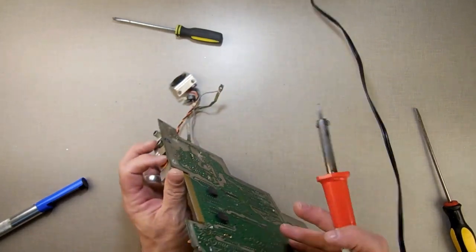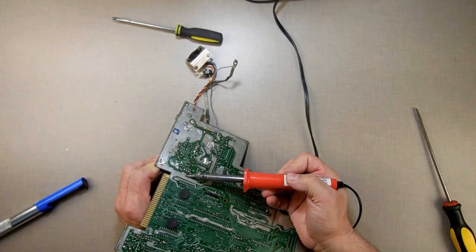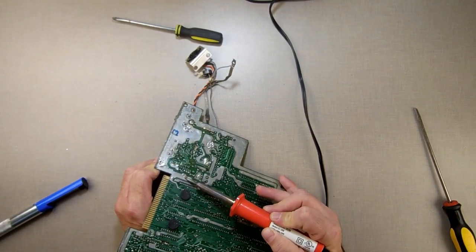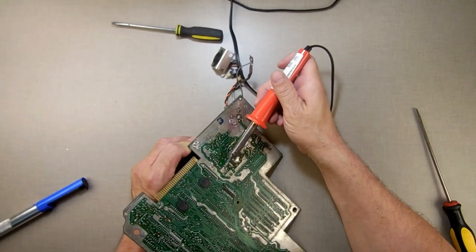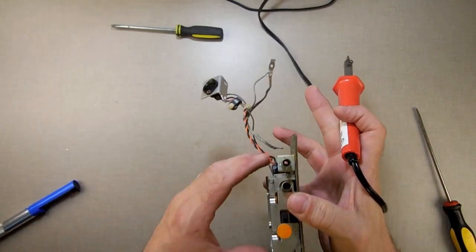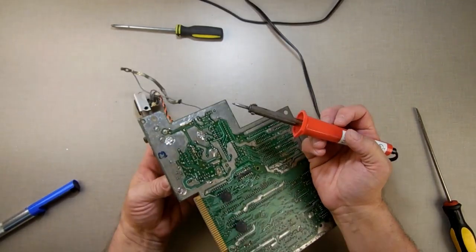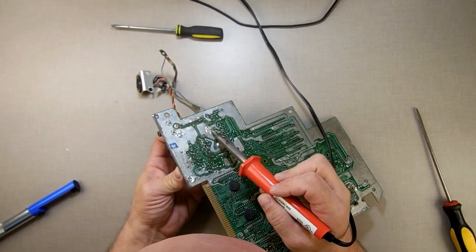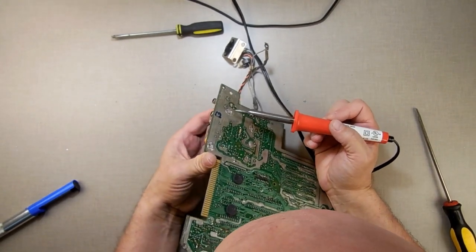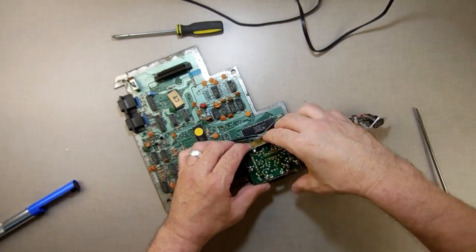I'll try by hand — it's just going to get hot on my fingers. I'm trying to get enough leverage on it. See how I popped that out? I'm pulling on it from the bottom and heating this up until I can get it out. A little splash of solder on the finger got a little hot there. So we got one, two, three out — we have a few left. This one's just about out already so I'm going to hit it with a little more heat. That's out. Last one: just pulling down gently and heating this side up so it lets go.